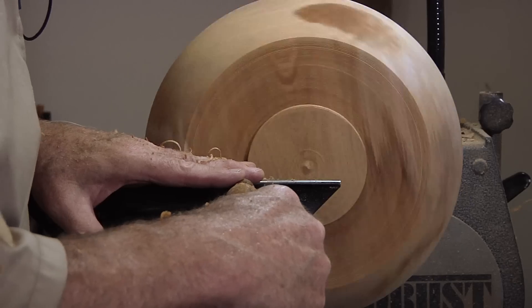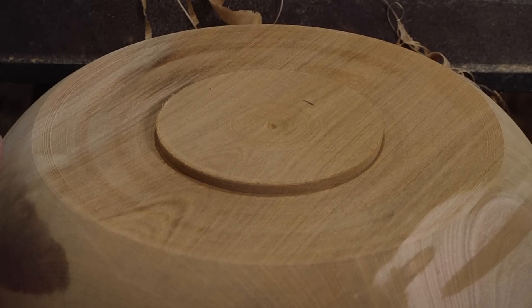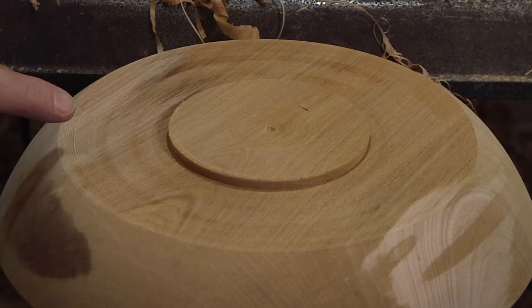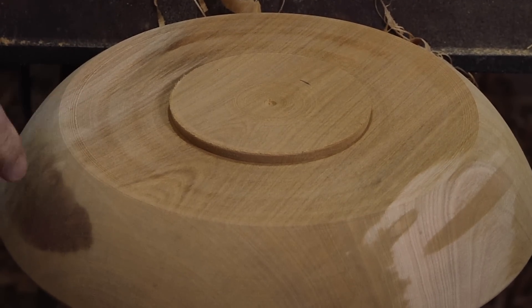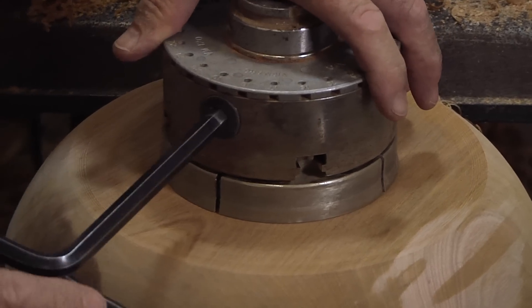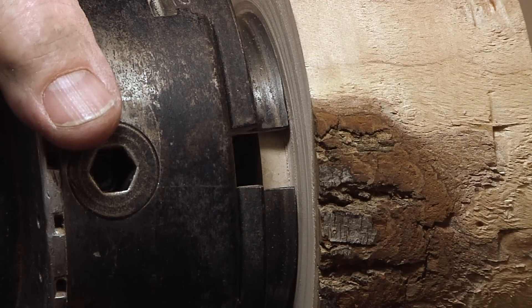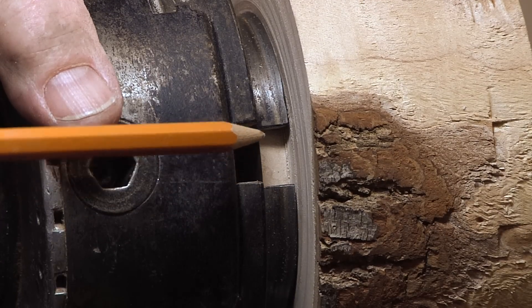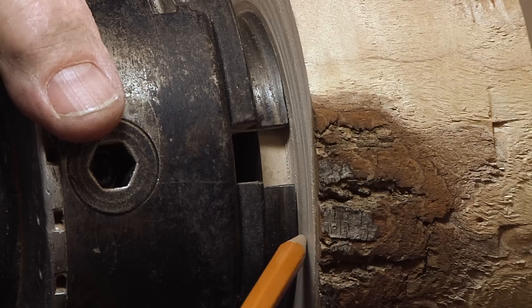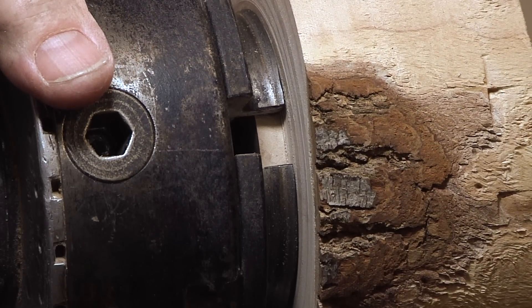I like to hold it just very, very lightly to take some of that bounce out. Until you develop the skill of being able to hold it up to the chuck while it's on the lathe and wiggling it until it's seated properly — this is more of a problem with bigger blanks. You can put it on your lathe or on the workbench, put the chuck down on it, loosen up until it fits, and snug it up that way. That will get it pretty close to running true. Here's another view of a tenon — there's a little gap between the jaws, but that's not too bad; that will hold. The jaws are flat on the wood and the tenon does not bottom out in the bottom of the chuck — it's only down about a quarter of an inch. That's a good secure fit.